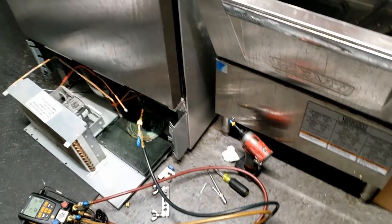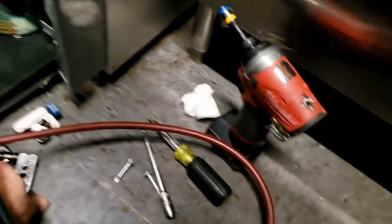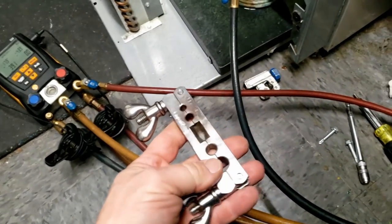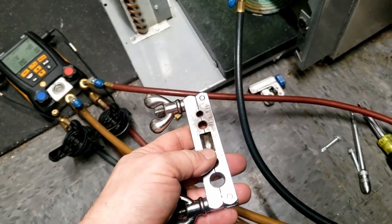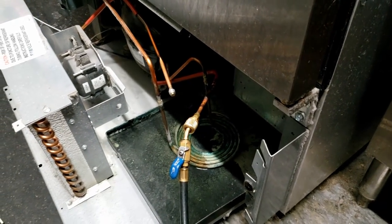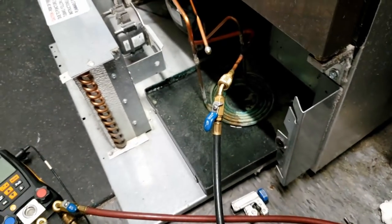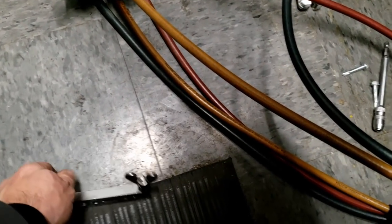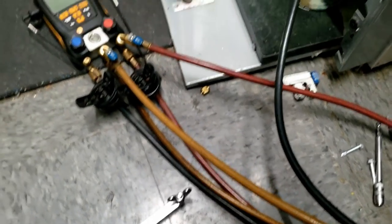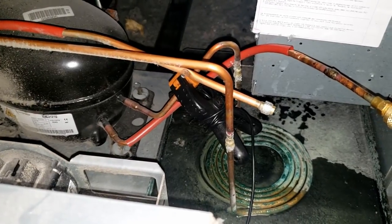You've probably seen other people do it - what I usually do with this quarter-inch line: I pinch it, cut it, make sure there's no leaks, put an already-swaged quarter-inch fitting on there, undo it, reround it, do my thing, pinch it back off, rebraze it, and you're good to go. I like that a little bit better than the saddle taps that are usually garbage.